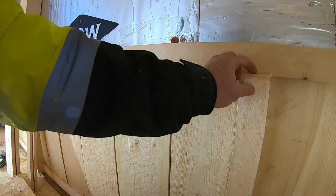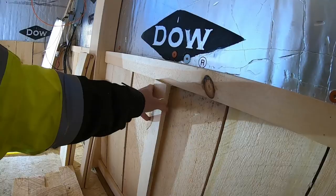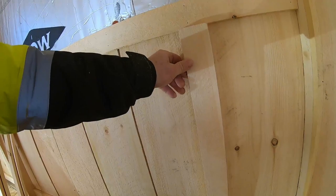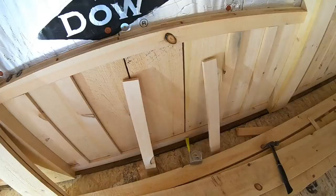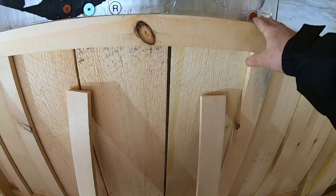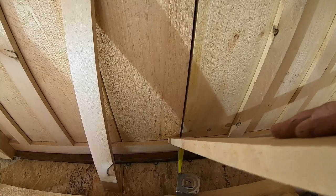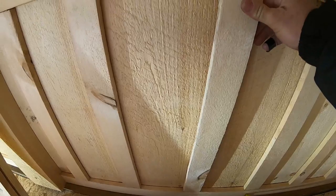I'm gonna start doing the bats. I got them all cut and they should all be the same, roughly 27 and a quarter, if you got these right in the beginning. You just find one somewhere because of the crown, so this one's a little tight. Cut my bats — they should all be within 27 and a quarter if you got all your measurements right with the top board and the bottom board. Fit them real snug and don't nail them one at a time, get them all up first, because they may be offset left or right a little.